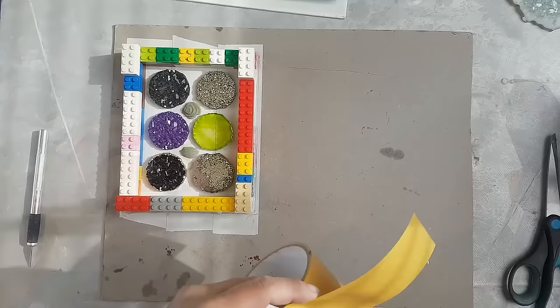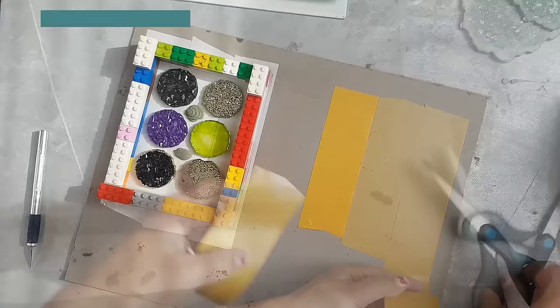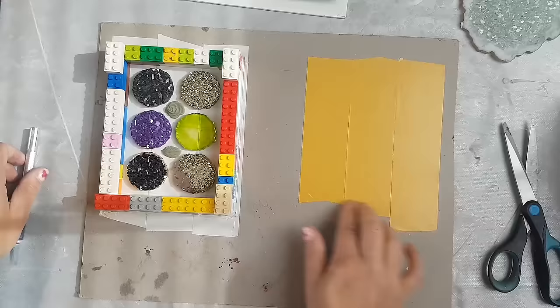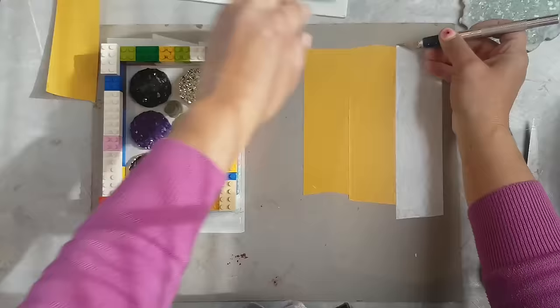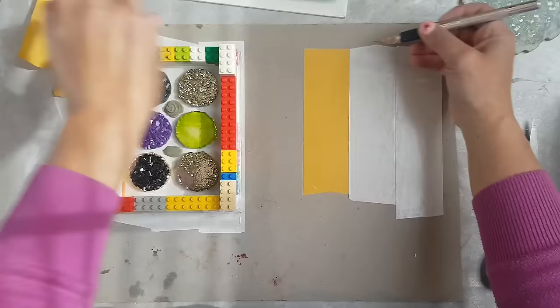And method number two is for irregular shaped masters such as this coaster, and for this I like to use plasticine, but you can also use Play-Doh, Fimo or clay as a barrier. And once again I'm applying some double-sided sticky tape to embed my master into, and since this is already sticky and I've pushed it down into the sticky tape, I won't need any hot glue to seal the sides for this particular method.